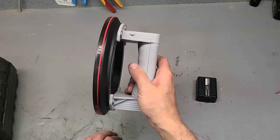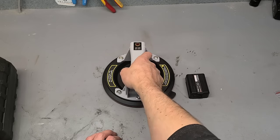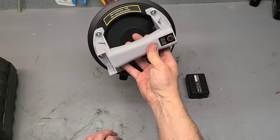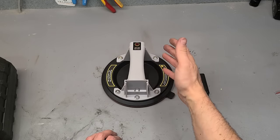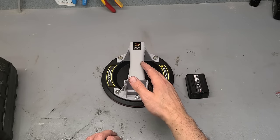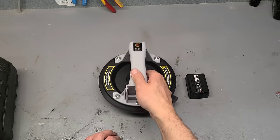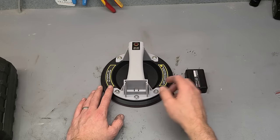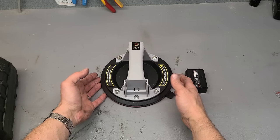But units like this are what's being used now — battery operated suction cups. It always surprises me just how many people don't realise you can get these; they're still using the old manual ones. Fair enough, for lighter stuff the manual ones do the same job. But when it's heavier stuff, or more expensive items you really can't afford to drop, these come into their own. Being battery powered, it's going to be easier to use, you'll get more suction out of it, and therefore you'll be able to lift bigger loads.